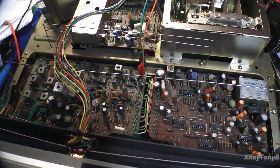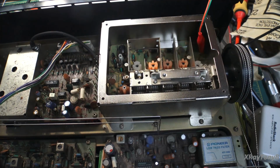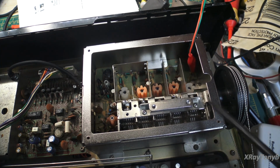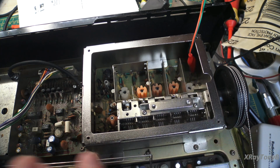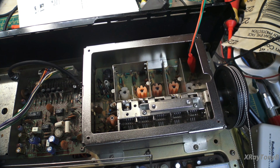And there it is. Now, if I move this over to the input over here, I'm going to do that right now. And you can see I have it hooked up. I've not changed anything else on the signal generator or anything. And typically on these tuners, on an FM tuner, if you inject it right at the input where the antenna would be, the 10.7 should pass through all of this, because all the filters and everything are set to allow that frequency to pass. So typically you can actually get your IF to go right through there.